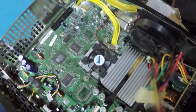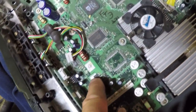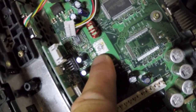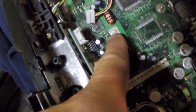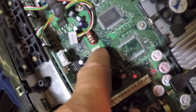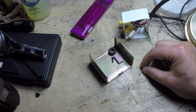The Xbox had a bad optical drive. You can see there are a couple of surface mount devices here—that spot is where I pulled the N-channel MOSFET from; there's another one right next to it but I think I damaged that one trying to desolder it. The problem is that the PCB substrate there acts as a heat sink. I was finally able to get it desoldered. Another concern was the pinout of the device.